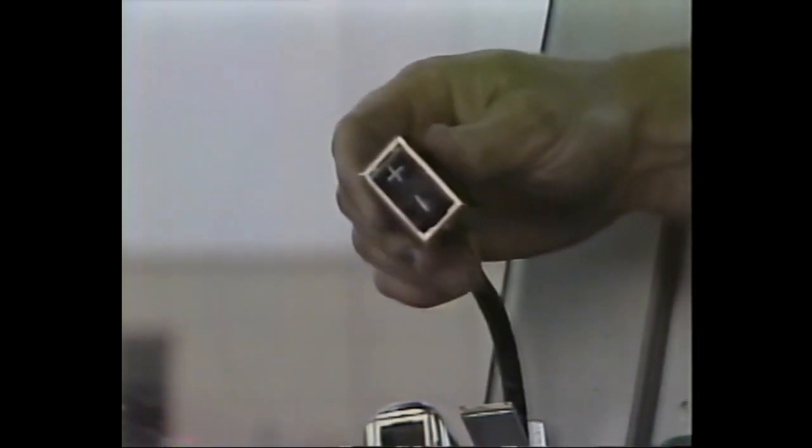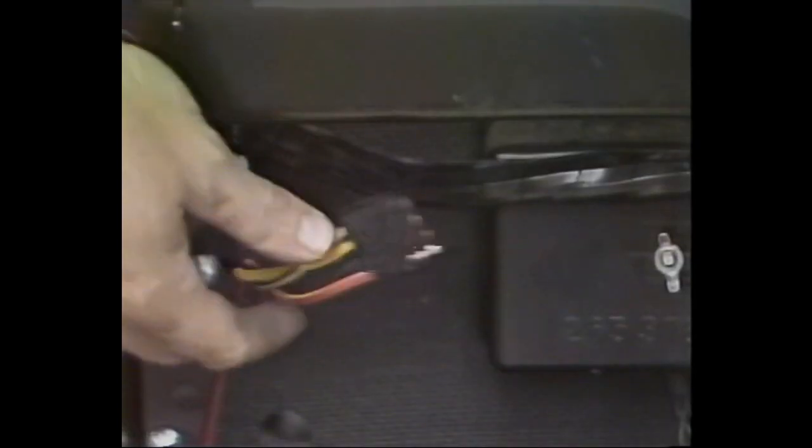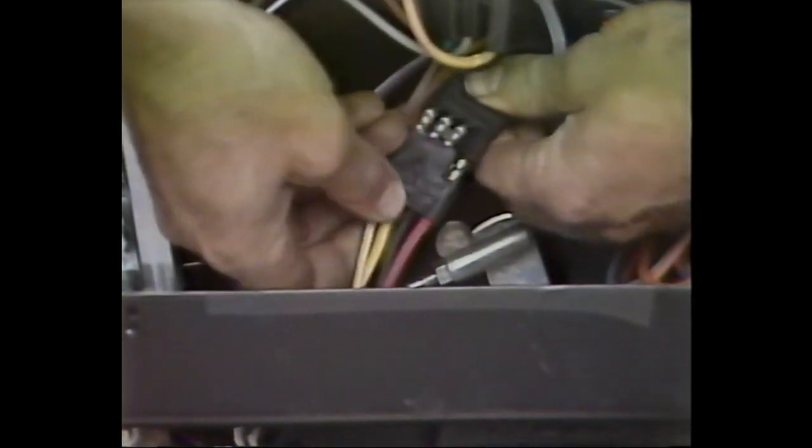The first step in doing this is to insert the wires on the control button into the opening in the end of the reel height control lever. Continue pushing the wires into the opening, and finally insert the control button into the opening. When the button is in place, reach under the console and connect the leads to the wiring harness. Then plug the wires into the socket under the operator's platform and bolt the wires to the vertical elevator with the clips provided. Leave sufficient slack to allow the elevator to be raised or lowered.